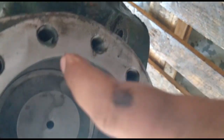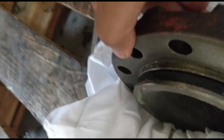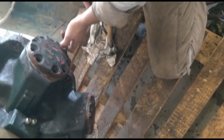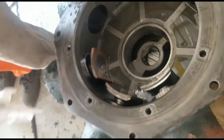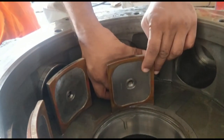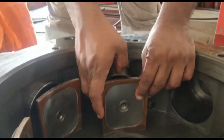Check the cylinder liner surfaces and change the cylinder seal ring. Secure the cylinder heads. Change the piston sealing rings, check the piston shoe, lubricate, and place the pistons inside the cylinders matching the markings.